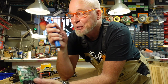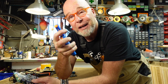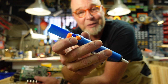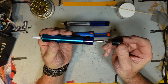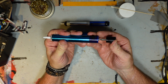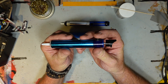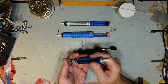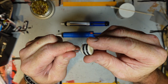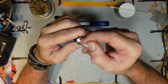Just last week I needed to unsolder a fuse from a circuit board, so I used a manual solder sucker like this one. This type is perfect to illustrate the principles of the solder sucker. Basically a spring-loaded piston rests inside this tube. The spring is compressed manually until the rod and piston lock into this notch. Press the trigger and the spring forcefully pushes the plunger back to its resting position, creating a vacuum which sucks in molten solder. This rubber O-ring is what assures an airtight seal between the piston and the tube. Additionally, the tip is heat resistant but can be damaged if overheated.